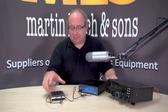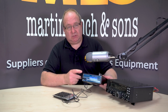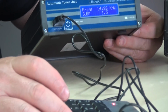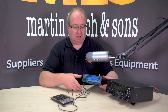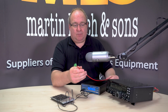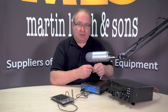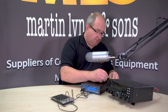And how does it actually function. Well, the baby loop itself comes with a controller, this version 2 controller, with a USB front end, which will allow for things like firmware updates and the addition of a keypad. Once you've got this and you've set up the cable, one thing to point out: you're going to need to provide your own DC motor drive cable, which we carry in stock anyway. I'm just using a plain old bit of DC line there, and make the connections as necessary, and that simply plugs into the back of the actual unit.